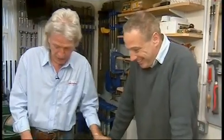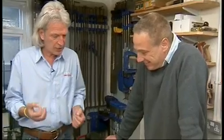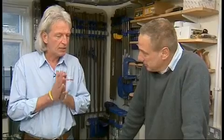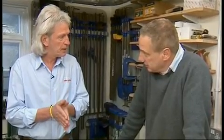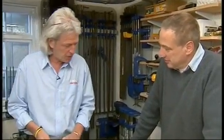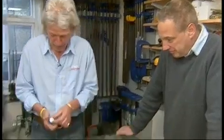Anyway, going back to your router bit. What I suggest to people is, depending on what quality of router bit they're buying, I would actually sharpen them from new to make sure they're as sharp as the manufacturers want them to be, because then they're working the most effectively. Where people tend to go wrong is when they're using a router bit and it tends to get a little bit blunt, and then, oh, I'll just leave it one more time. Or then you have to send them away, and as you rightly say, they grind about 30 or 40% off the face.